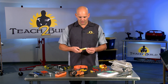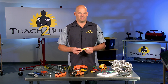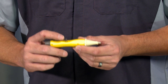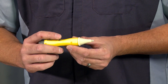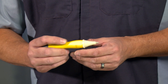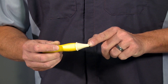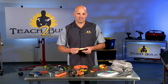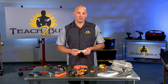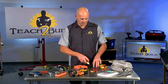Another way to tell if there's power at something is with one of these — I call them a volt tick. Basically, you hold the clip down until you see the light come on, and then as long as you hold it down, it will detect voltage even through insulation. It has a narrow blade on the end that lets you reach into an outlet to make sure it's not live before you work on it. They're not expensive — ten or twelve dollars.